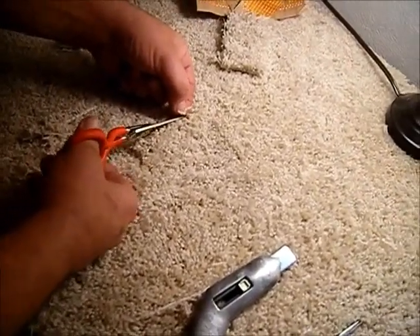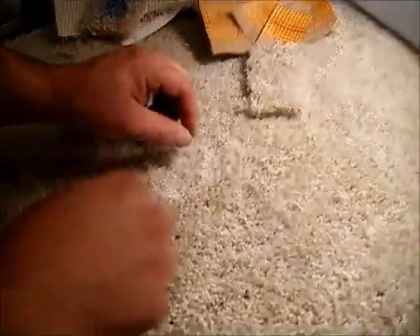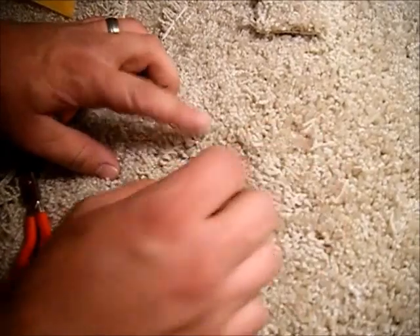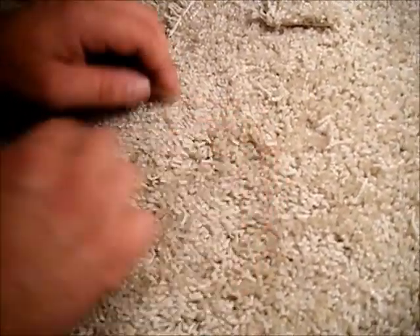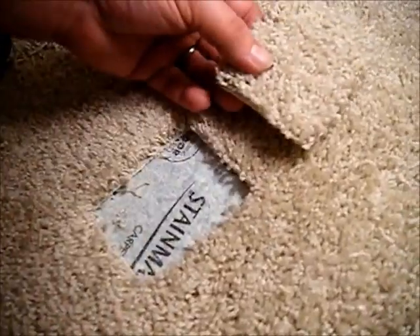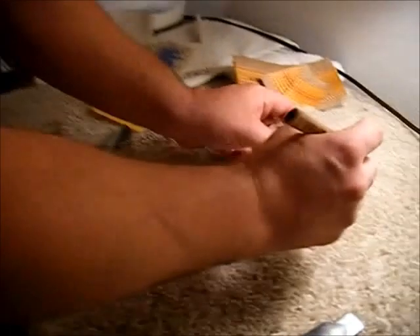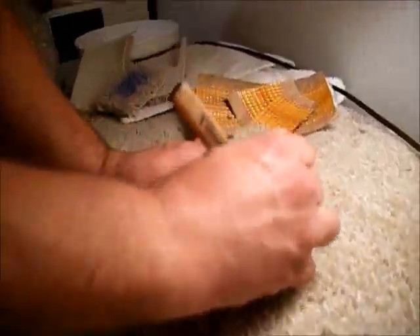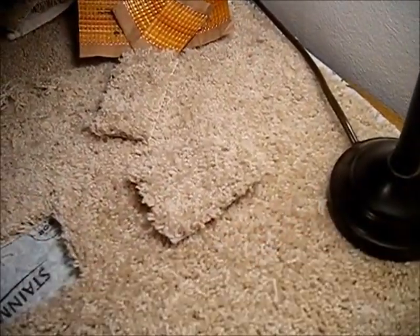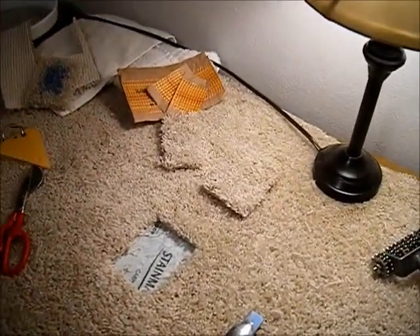A little more trim right there — making sure that we're not trapping any face fibers. So now we have a dry fit, and that is to make sure that once we set this, it's permanent. We have a pretty good dry fit. I'll turn that piece and mark with a carpenter's pencil on the back toward some landmark — in this case the wall — just so I do not allow that to become turned around and therefore not fit.